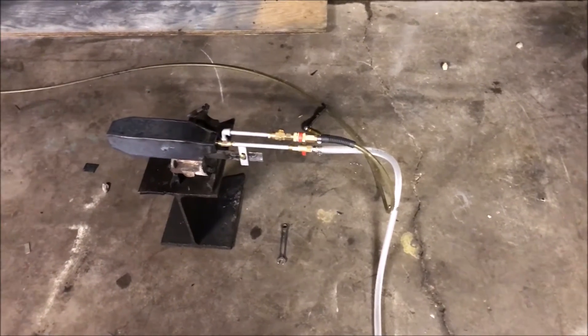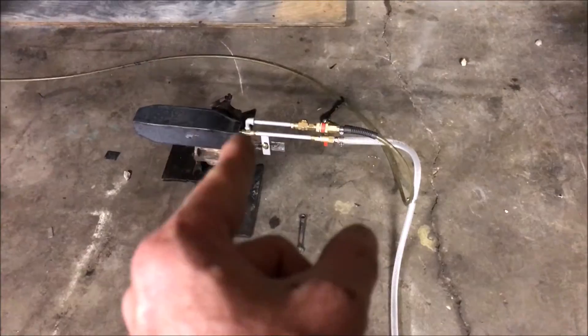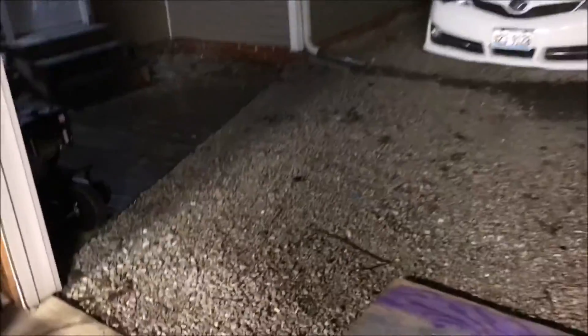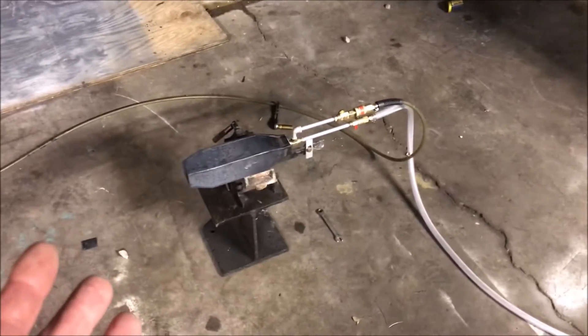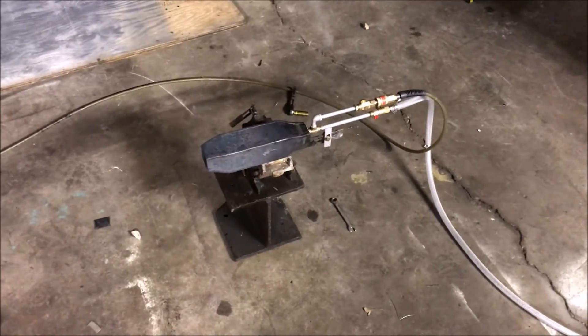The air input — I did not check the pressure, but I'm pretty sure this nozzle runs at 75 PSI back pressure on a 6.5 horsepower air compressor, which is a significant amount of power being dumped into this thing. The more power, the cooler, in my opinion. Not trying to win any awards for efficiency. If you can get the job done faster with a less efficient burner, aren't you still hitting your target mark?